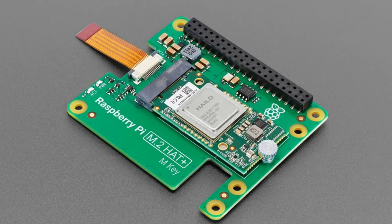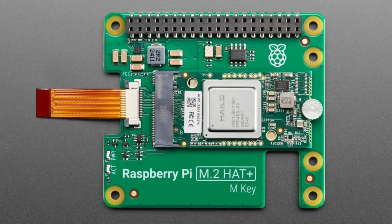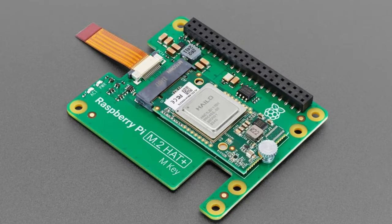Okay, we've got the new Hailo AI M.2 HAT kit for Raspberry Pi 5. It's only for the Pi 5 because you need the PCIe slot. But if you want to run TensorFlow, TensorFlow Lite at as good or better than desktop speeds, this AI accelerator uses the PCIe port and doesn't require USB, so you don't have to worry about USB slowing stuff down.